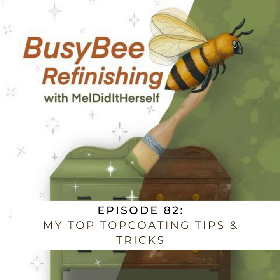Another important tip: if you're using a roller going through a piece — say the top of a dresser — I recommend doing long even strokes from end to end versus short ones. Cover the whole width of the piece and sweep from end to end, then do the middle section and the end section with those long sweeps. That gives you a much more seamless finish. I also recommend overlapping each stroke just a little bit.